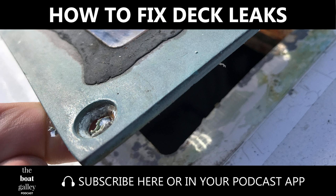Then you put your fasteners in. You want to make sure you are sealing the fasteners. I use butyl tape for this too — I cut a tiny strip of butyl tape in half, folded it in half, wrapped it around the top of the fastener, and then screwed that right down into the deck. That way the sealant comes around the fastener and protects it, because if you don't put sealant on the fastener before putting it into the deck hole, you're actually inviting water to get in and potentially cause deck rot and bigger problems down the line.